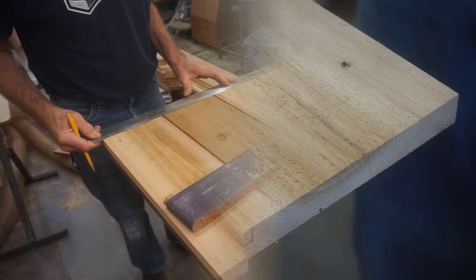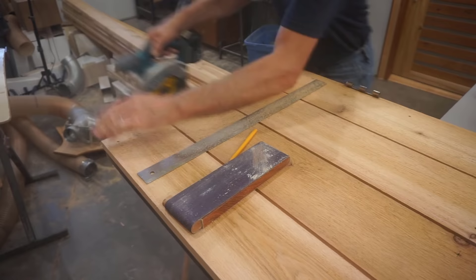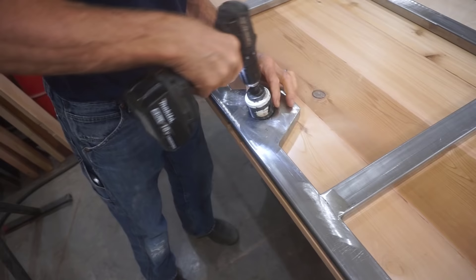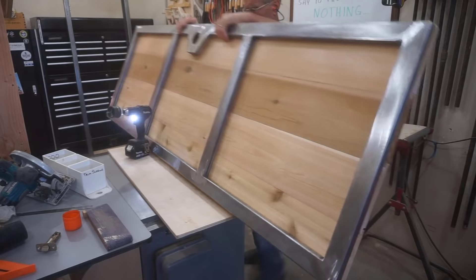With all the screws driven, I carefully mark the door bottom with a straight edge, trim it off evenly, and finish up by deburring it with an 80-grit sanding block. And now, last but not least, I'll do some jujitsu with the door — flipping it over twice to first start and then finish drilling a 2-1/8 inch hole through the shiplap siding to accept the doorknob later.